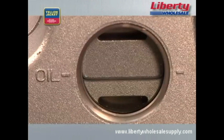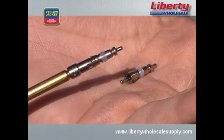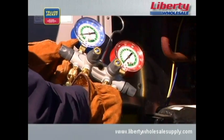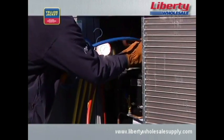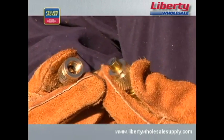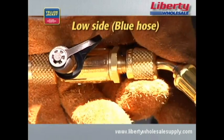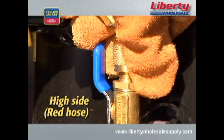A quality two-stage pump will work with any refrigerant. It's recommended that a high-vacuum, mineral-based oil be used in all pumps, regardless of the type of oil used in the system. Once you can see through your sight glass that you've reached the proper oil level, put the fittings back on, or if desired, attach the exhaust filter. Remove the Schrader cores if present with the core removal tools. Install the test and charging manifold — for this demonstration, we're using a four-valve manifold. Connect the hoses from the manifold to the system using three-eighths inch hoses for a faster and deeper vacuum. Connect the low side or blue hose to the low side core removal tool, and the high side or red hose to the high side core removal tool.